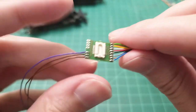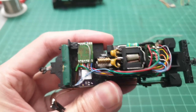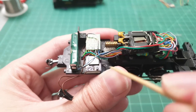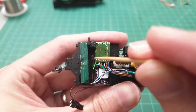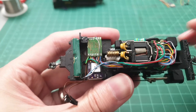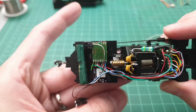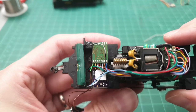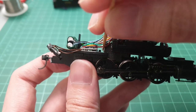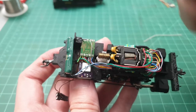So this decoder is plugged in right here. Here is the decoder — I first put some double-sided tape, but that didn't stick well enough, so I put a blob of PVA glue there and another blob there. I use that glue because it's soft, so I can just cut it away if I have to remove the decoder one day. It's important to keep it really well positioned because with the new DNH plug, it just barely fits in this direction — I had to force these wires over there a bit. If it slides forward, it will hit the gearing right there and chop away at the electronics. So that one has to be secured, and you also don't want these wires getting in there.